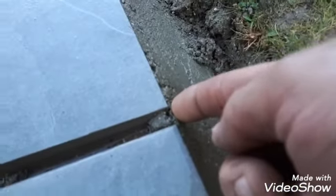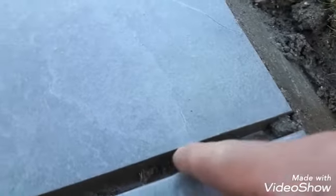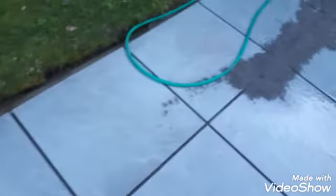One little tip: when you do the joint, when you're laying the slabs, put cement up the ledge so the resin doesn't run out. Backfill all your joints as you're laying slabs, so you don't have big massive holes — because it's not cheap. If you have big holes it will eat loads and loads of grouting material.